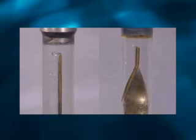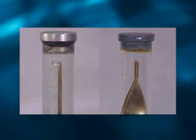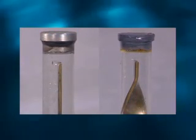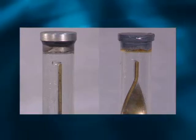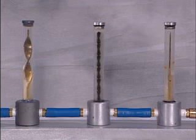Notice how both brass baffles permit coolant blow-by — a condition where the coolant takes the shortest path of least resistance as it travels through the cooling channels. Coolant at the end of the brass baffles is stagnant and is not circulating through the cooling system. There is very little heat transfer occurring at the end of either brass baffle.